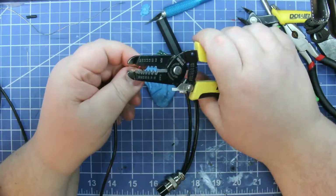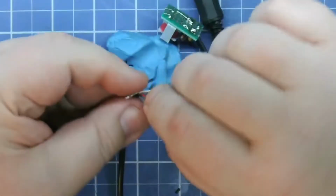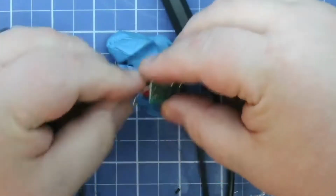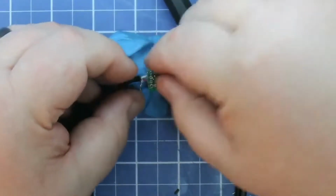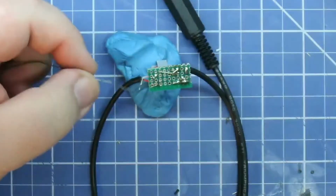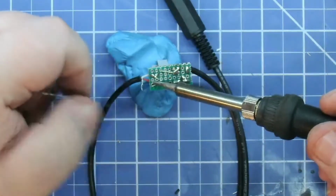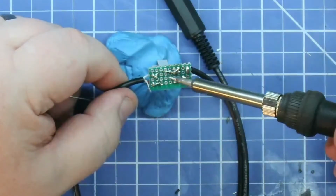So like I said, you'll have tip and ring. The tip of the mixer, the 1/4 inch jack, is your positive. You want that positive on the same side of the transformer as the starting winding. If you notice, there are 2 dots on that transformer. That's where the starting windings are. So basically, you want it on the same side as the positive output of the transformer.